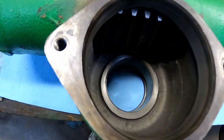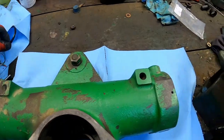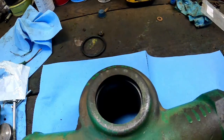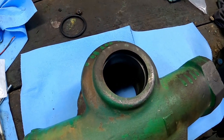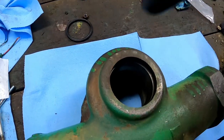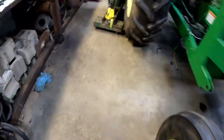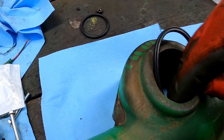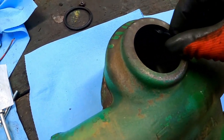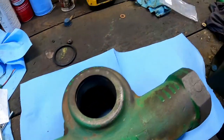I've got a new quad ring to put in the bottom. Here's the AGCO part number for it. Here's the old one — they call it a quad ring: it's a rubber o-ring, but other than normal o-rings it has four sides to it and seals better. Got the steering box flipped over. This can be done in the tractor — I've done it before, pulling this gear out — if that's the only thing leaking. It takes a little finesse reaching down in there, but it can be done without disconnecting all the steering lines if all you want to do is replace this bottom quad ring.